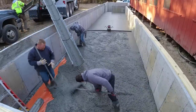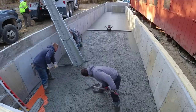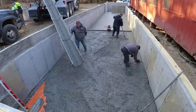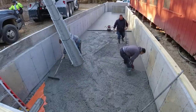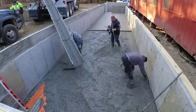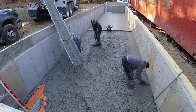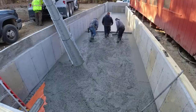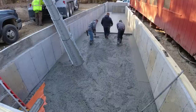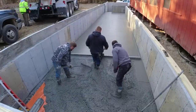We got really lucky on the width of this one. The power screed has a 12-foot board and it just fit inside — the inside dimensions were about 12 feet 8 inches. Otherwise we'd be screeding it by hand. That mix is a pretty nice mix too — the aggregate, the cement, everything makes a really nice paste and gives you a really nice smooth bull float finish, and using a vibrating screed makes the bull float finish look even nicer.